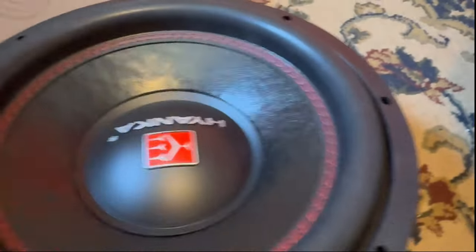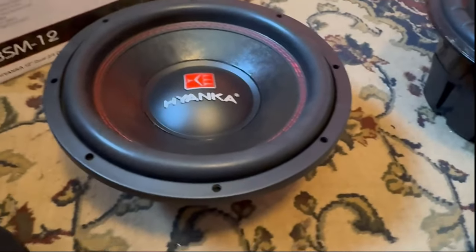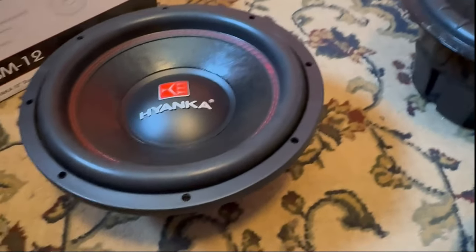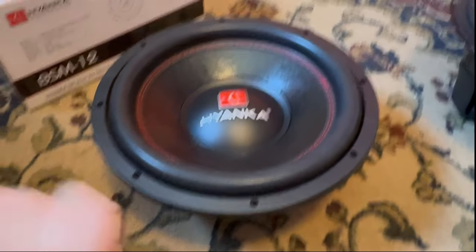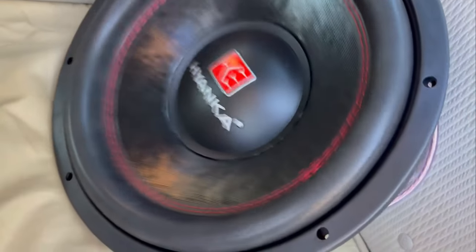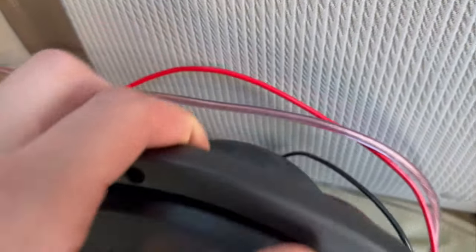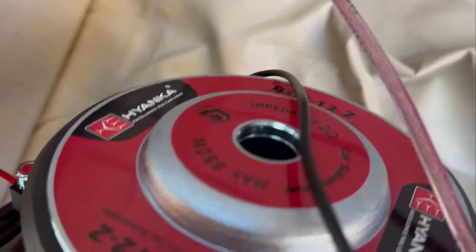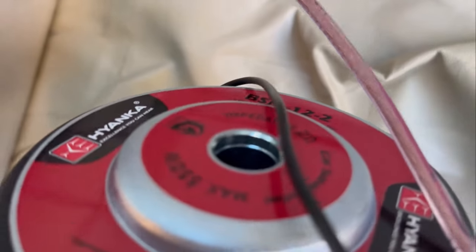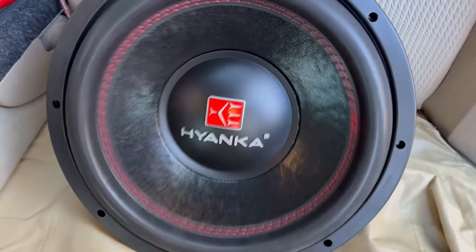The venting is pretty good — it's clear glue on the coil. We'll see how well it can handle its RMS power; I really don't think it can do much more than 250 watts just looking at it, but we'll see. We'll do a brutal RMS test and a music test, but first we need to break this sub in. We're doing a sweep from 20 to 50 Hz for less than half an hour just to get the spider moving. There's also some exhaust venting in the back, which is really nice — even the Deaf Bonce box doesn't have that.